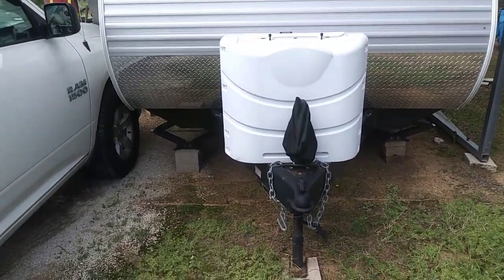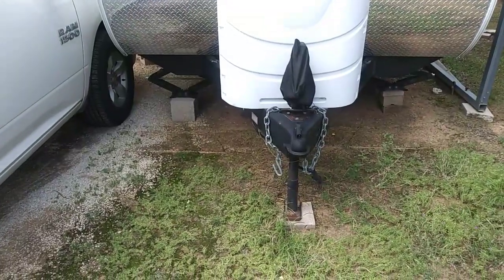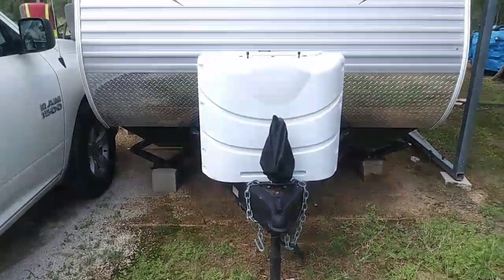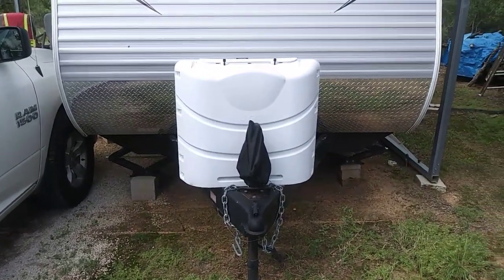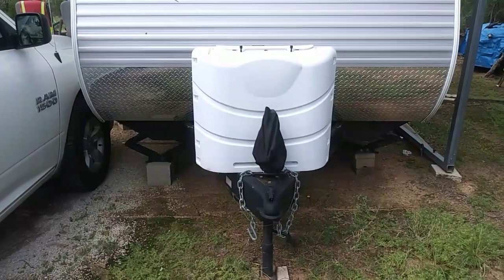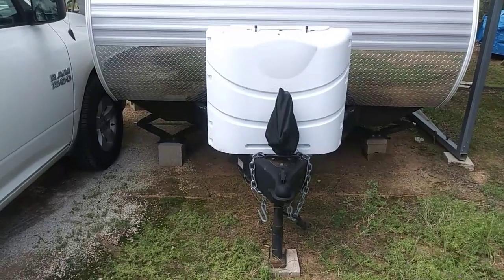But anyway, having said that, guys, for you new guys to RVing, those hoses on my RV are about 4 years old, and they've been protected from the sun under that cover, so they should have lasted longer than that. It must have been a cheap brand or something. But anyway, I did order 2 more. So anyway, guys, check your propane connections using soapy water and a spritzer.